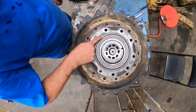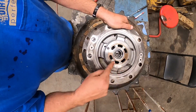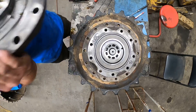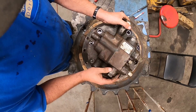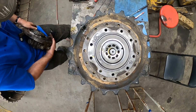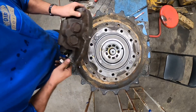I'm going to voice this section over - real life Mike did not do a very good job explaining this. So there you see you've got three holes in that manifold ring. That one there is actually for your high-low, and then the two on the other side are actually for your forward or reverse - it depends on which way you're going, which one's pressurized and which one's not. This center ring, if you look at the holes on one side, there's three of them, and holes on the other side - that's how the oil gets on top of those pistons. This thing does have to be oriented in the correct direction. I put a paint mark on it to line everything up. There's also a concave washer that has to go a certain way - the concave goes up, the dish goes down. Double checking, triple checking - we're going to make sure this thing is all lined up. All the O-rings are in place. We're going to drop this down on there and get her bolted up.